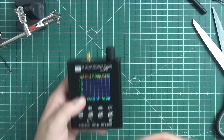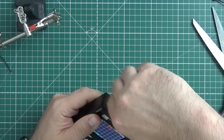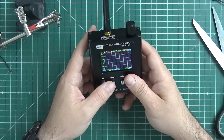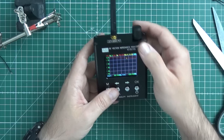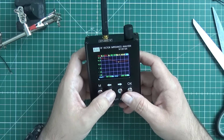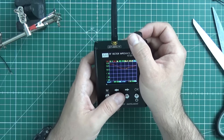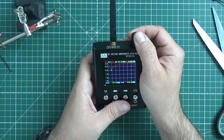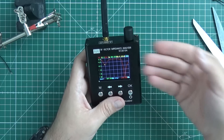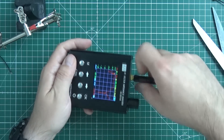You see an antenna and you know how good it is. This different antenna, for example, is a 2.4 GHz antenna — not behaving correctly when the range is set wrong. Let me move the range. And there — perfectly tuned antenna for 2.4 GHz. How nice is that?